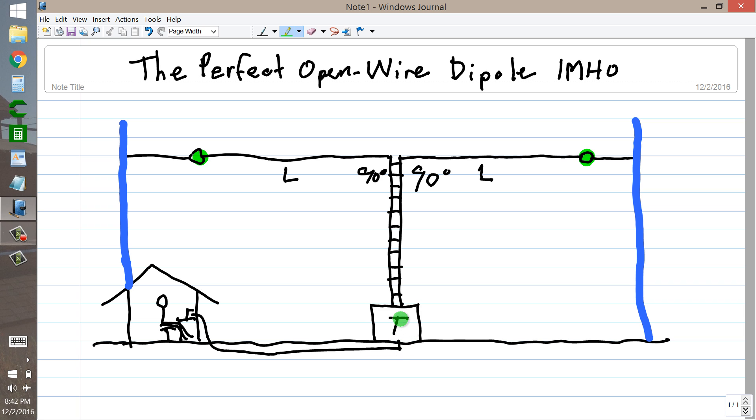In any case, this was used as a backup antenna. As I said, it ran north and south. On today's 40-meter band it would probably be something between a half and a full wavelength long. But it didn't really matter when you have open-wire line like this with loss that low. The 90-degree angles here ensure a minimum of antenna currents on the feed line.